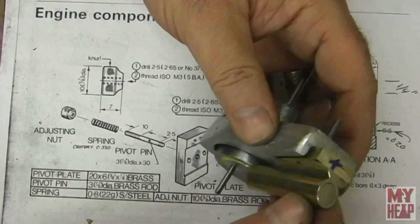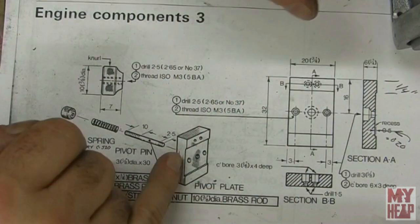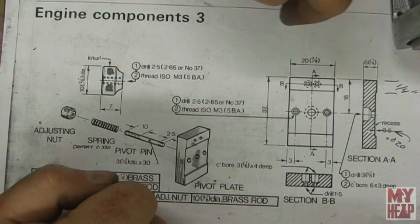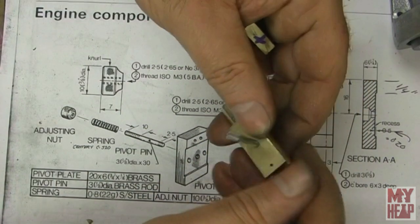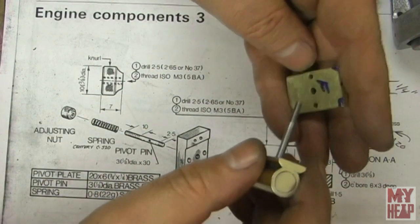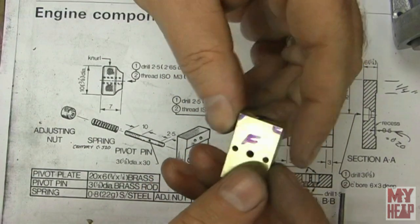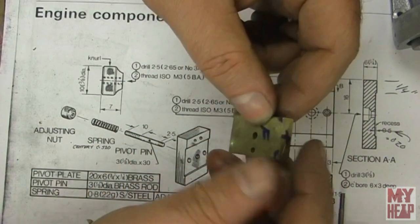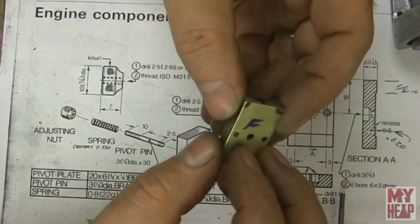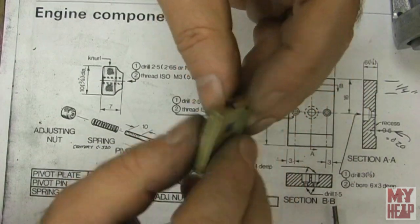The next thing on the plate is a subtle relief — about 20 thousandths deep — leaving just a quarter inch raised boss. The steam inlet hole is about three millimeters down, so if that's in the middle, a six millimeter pad for it to rotate on would be fine. We'll put the pad at the top and bottom and relieve the middle to reduce friction. Let me get this marked up and get it in the vice — I'm just going to file that down. 20 thousandths is just enough to relieve this face from touching that face.